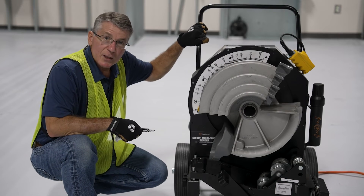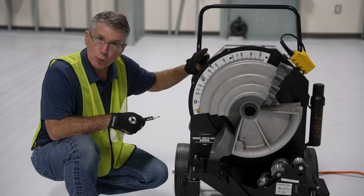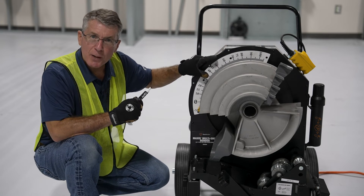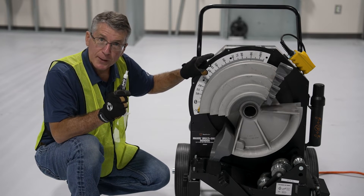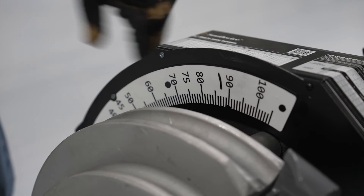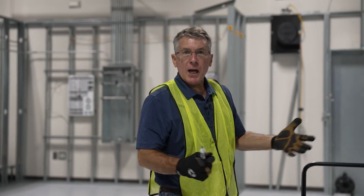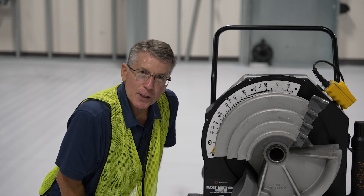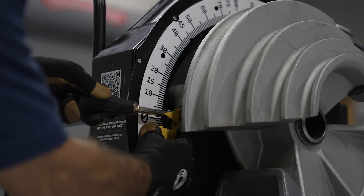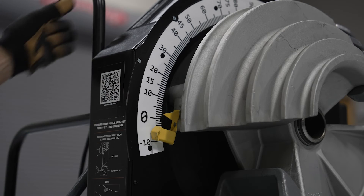Another great convenience feature is that the MSB2000 has a very high contrast protractor — black against white, very easy to see — and it has single degree marks for better accuracy. Another great thing is that you can mark your next bend, which a lot of guys do in the field, and if necessary, you can easily erase it for the next guy. Great bends start at zero degrees, so the MSB2000 has an adjustable shoe pointer so you can adjust it at the beginning of your bend exactly to the zero position.